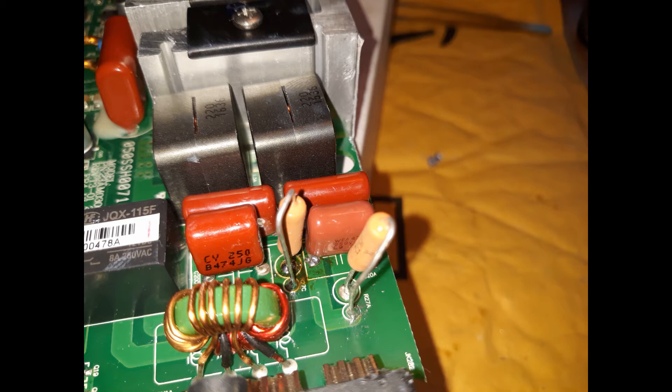To remove the old components, turn the board upside down. Clip off as much of the terminal and solder as you can with some wire cutters. Use the soldering iron to heat up the solder at one of the terminal points, then pull on the resistor from the other side until it slides out. Be careful when using a soldering iron not to heat up the metal reinforcement around the hole and damage the board.